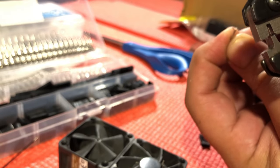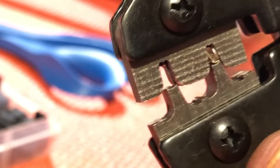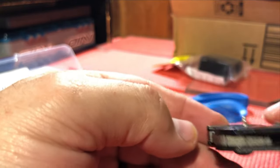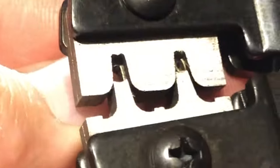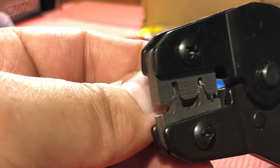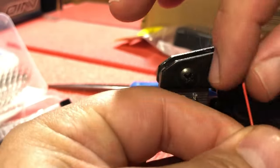So I'm going to come in from the back side, open it up, set the terminal on top of the peak, and click it into place so that the large flap is on the large gap side. Now the terminal is held in place and ready to go. Look at the side closely — you want to make sure that the plastic inlet section is completely free from being crimped. I'd even pull it back just a slight bit to play it safe, because you do not want to crimp that end and damage how the piece inserts in. Make sure the wire is twisted.